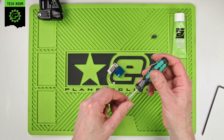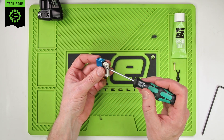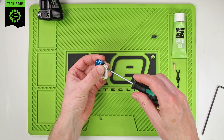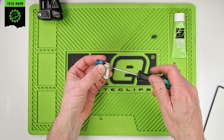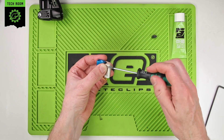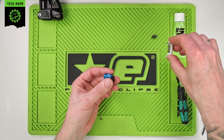You're going to need a very small screwdriver — this is a Phillips head zero size. Zero will do all four of the screws in the solenoid assembly. First thing we're going to do is remove the pilot. The parts in the pilot are non-serviceable, and that is just this small cream and silver assembly here. Just place that to one side; there's nothing to service inside that.